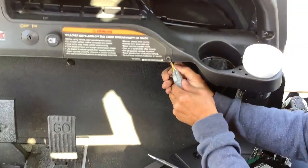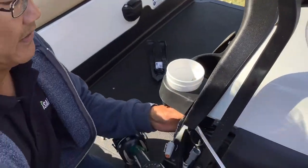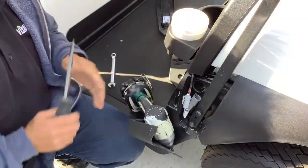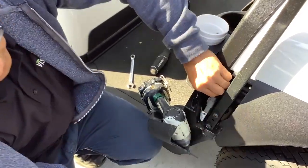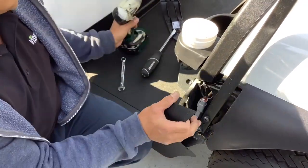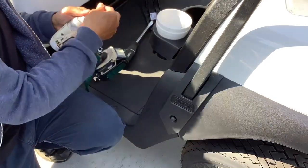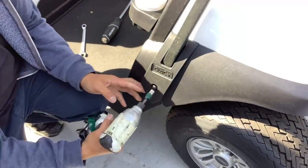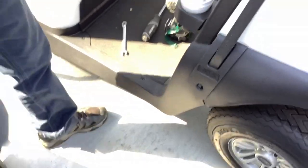Find your Deutsch connection and get it in. We're tucking it behind the cup holder — lift the cup holder and get the wire back up behind it through towards the front. Use a flat head to pry up and get the wire out underneath the cowling. Make sure your wirings are correct, connect it straight, and make sure it clicks and doesn't pull out. When connecting the straight connectors, check the pins to make sure they're straight. If you push too hard and bend a pin, you won't get the correct connection, which could cause issues powering on the unit or reading the engine.